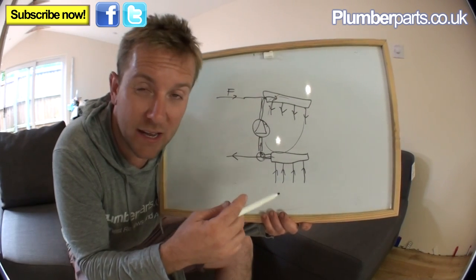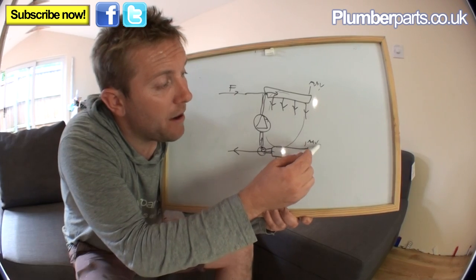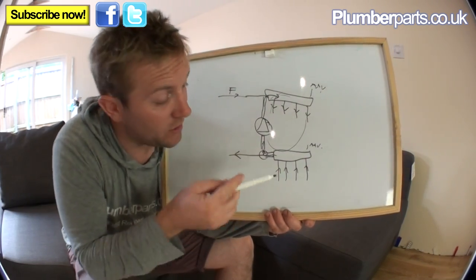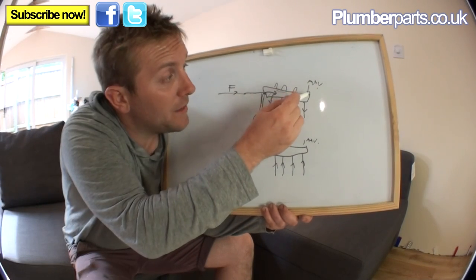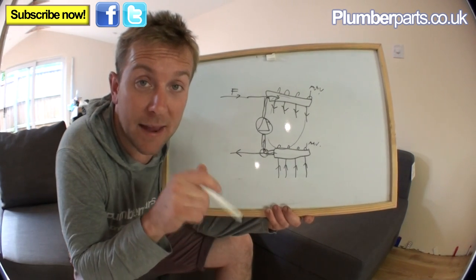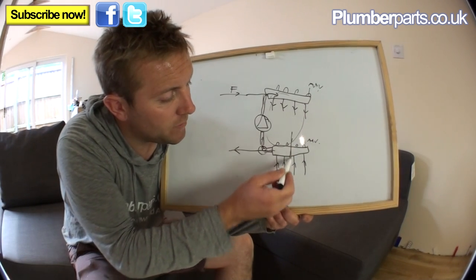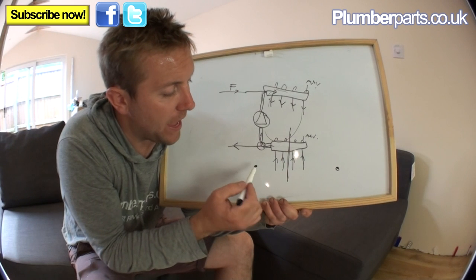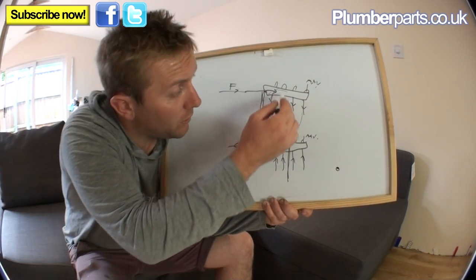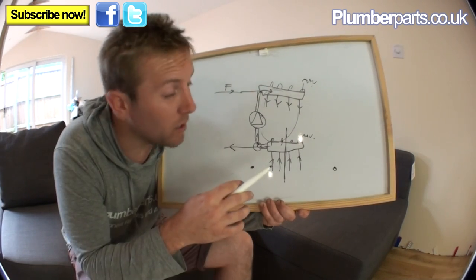There are a couple of other components to look at. Most manifolds have an AAV on the flow manifold and on the return manifold so you can vent it out. You'll also have your balancing valve heads along here, and then your actual valve actuators. The valve actuator talks to the thermostat in the room that you're trying to heat. Sometimes you can have a manifold that does two rooms - so you've got a thermostat for one room and a thermostat for another. If one room calls for heat, it lifts up that actuator, lifts the valve and starts allowing flow through, so hot water goes round that room. The other room isn't calling, so those valves stay shut and that room doesn't get warm. Basically it's like a very closely controlled zone.